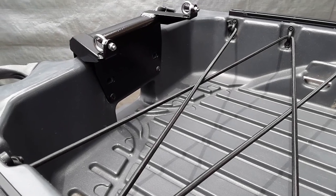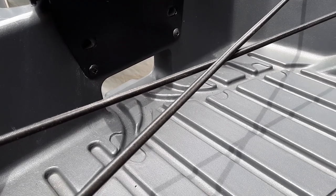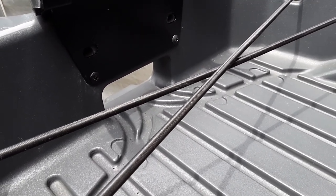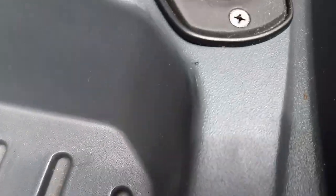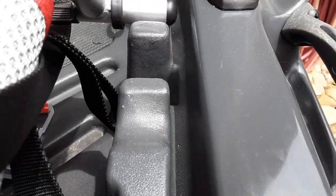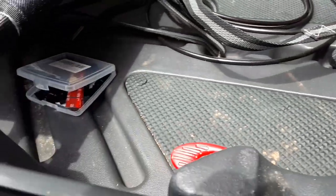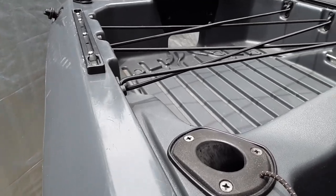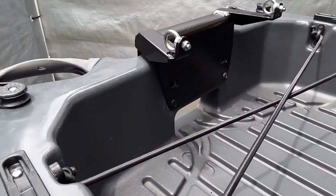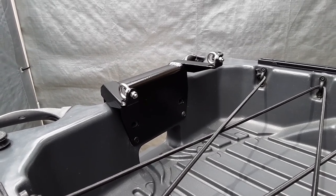This is a view of the rear section of the kayak with the outboard motor mount. As you can see down there, there's that exit area and you have the channels in there. That's made so you can run a rudder if you want and then run the control lines up through here and along the inside of the gunnel all the way up to the pedals. But I'm not going to be using the rudder because it has a very limited turning radius. I'm going to use those channels to lay down my quarter inch irrigation tubing for my steering line guides.